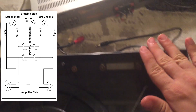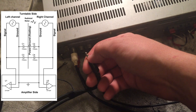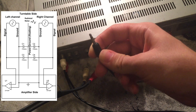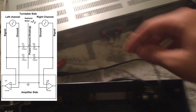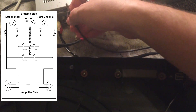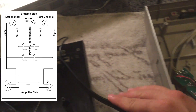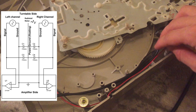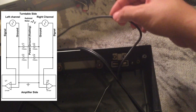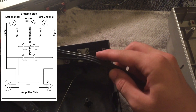These wires are meant to be connected — the grounds are meant to be connected inside the deck. So right now the ground section of this power cable is not connected to anything. This means I have an antenna right next to the delicate phono outputs of my turntable. Since they are very close and running in parallel, it is acting as a parasitic capacitor, and any voltage induced in this cable is going to be passed to these delicate phono outputs.